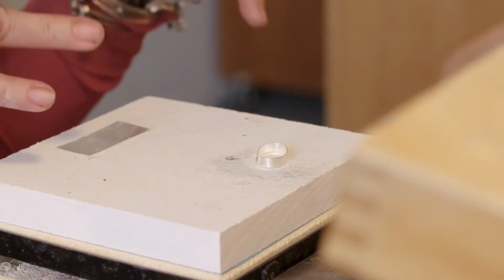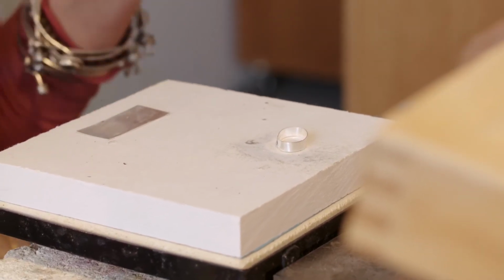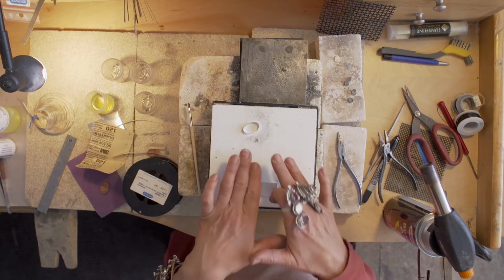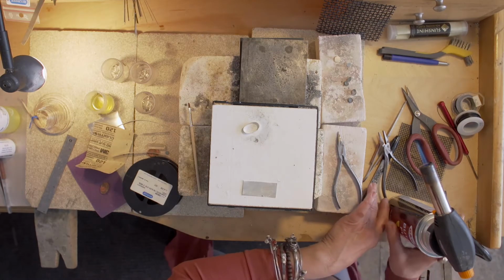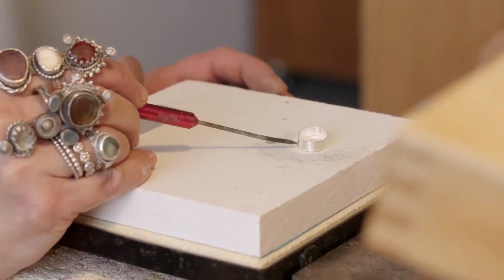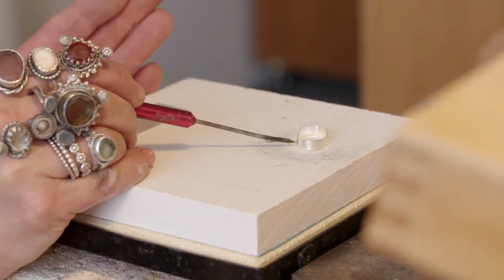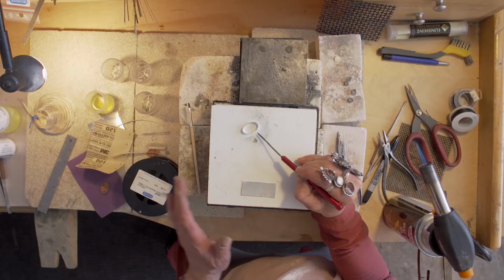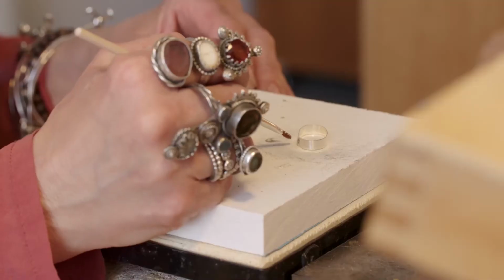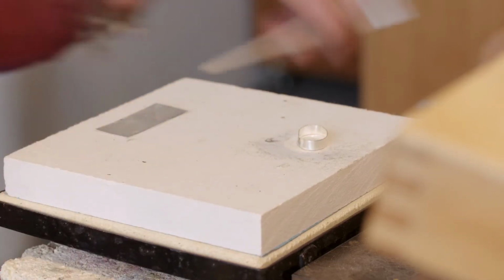If you've ever soldered before and put wet flux on and then put your solder on, it pops all over the place. So this is a really cool technique that I learned way out in the outback: just heating up your piece, putting your solder on here. My solder actually has to touch, so this is done really nicely. It has to touch both sides. It can only flow across each of the sides. This could be moved a little bit more to the right. So the only way I can get this piece to be moved over is I can take a little bit of my flux and just get my piece moved over by re-wetting it again. It really needs to sit in the middle, right like that.